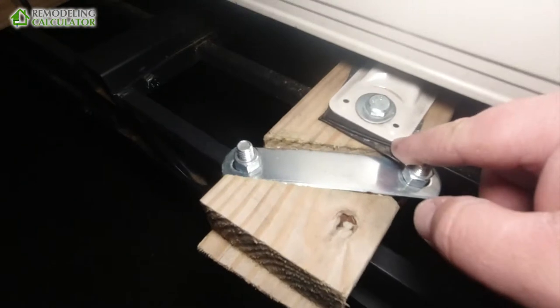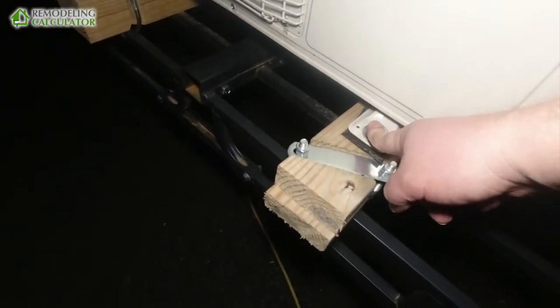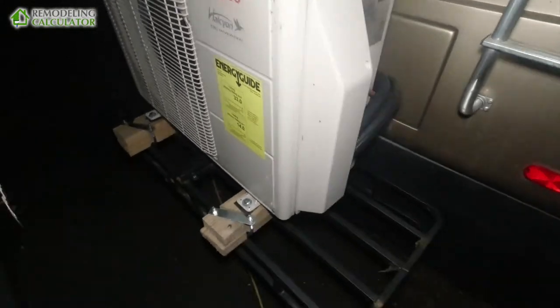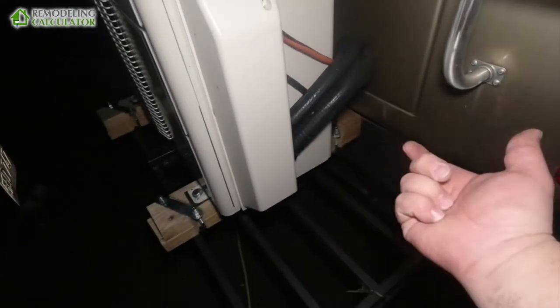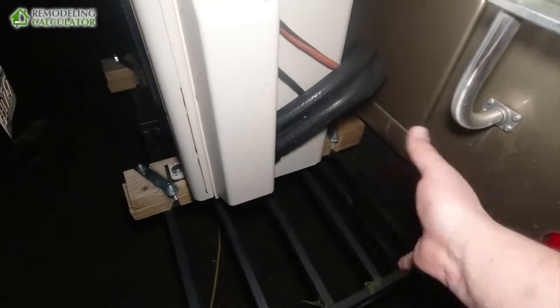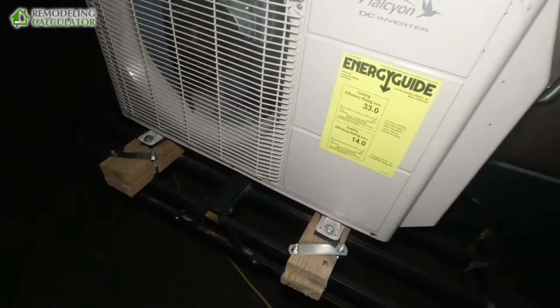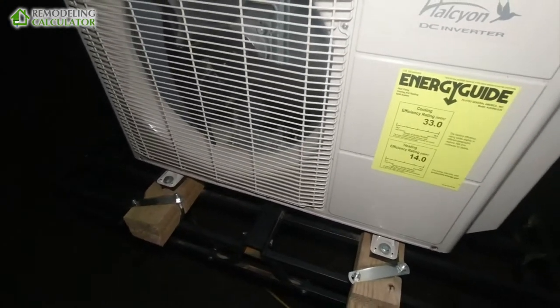I have this on all four sides. I put double rubber pieces on the bottom to minimize vibration and used stainless steel 5/16 bolts to bolt it down. This unit is only 70 pounds and it's very strong and sturdy. I already drove this unit and everything is good. To further minimize vibration where it goes into the hitch, I inserted a couple of big washers so it wouldn't shake too much. It's been working for a year heating this camper and doing a great job.